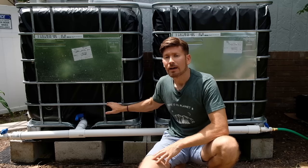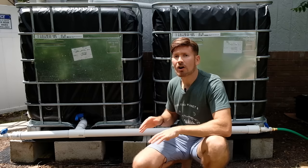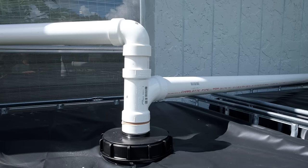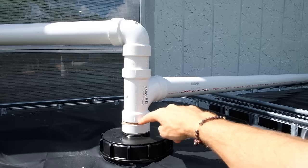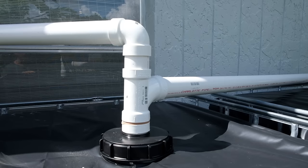The way this system works is that both tanks are open and connected with this pipe, so when this tank fills up, the water enters the pipe and both tanks fill up together. One thing to keep in mind is that these tanks are never empty — they're either filled with air or water. So you want to make sure that the caps on top are slightly loosened so that'll allow the air to leave the tank when the water fills up. Once the tanks are filled, the additional water comes up here and moves through this pipe — called the overflow. The water from the overflow can go to a pond, a banana circle, or a rain garden.